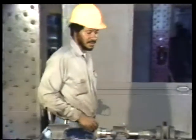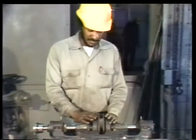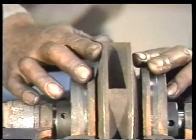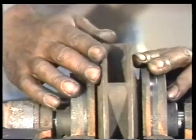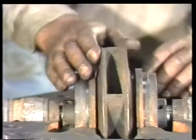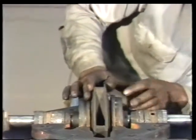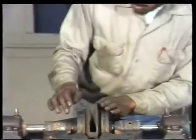Next, do a preliminary inspection of the internal parts. Start with the impeller. Look for erosion or pitting at the tips of the vanes and around the edge of the shrouds. Rotate the impeller a couple of times so that you don't miss any hidden signs of trouble, particularly around the outside surface of the shrouds.